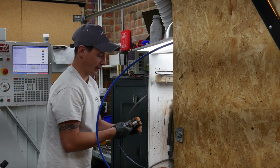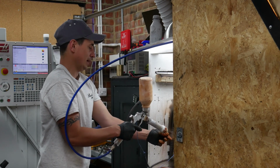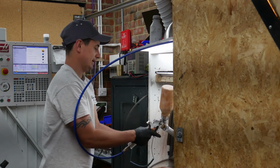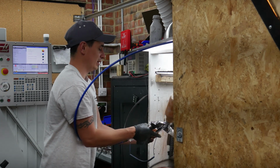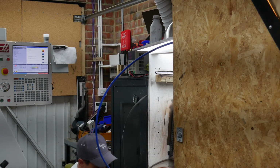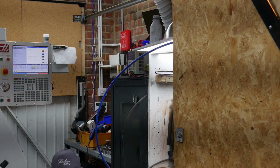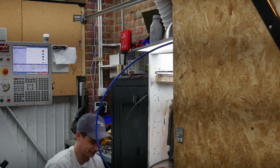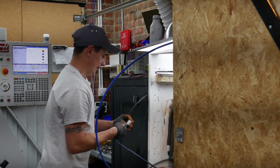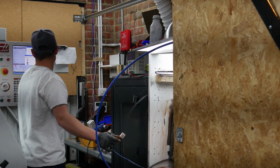I cannot wait. I'm hoping we get this grant application approved, and I cannot wait to move the powder coating into a proper dedicated space. I mean, the powder is being drawn away. Luckily, what I've done is I've turned the airflow right down on the powder coating gun, and so now we're not really getting any spillover powder that is going anywhere other than the extractor. It makes it a workable solution at the minute, but technically it's not safe for the guys,